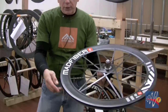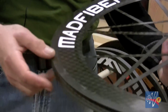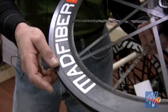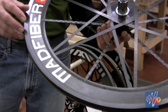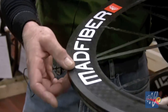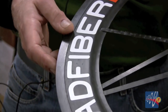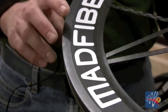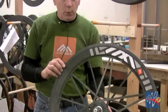If you look real closely at the brake surface, you'll see kind of a dullness — we put fiberglass over the brake surface for the sake of braking smoothness. We recommend the use of a cork-type pad that we're very fond of and provide with each wheel. The fiberglass brake surface gives a very nice modulation and weather resistance. It's raining outside right now, as is often the case in Seattle, so we're very concerned that you have full braking in the wet as well.